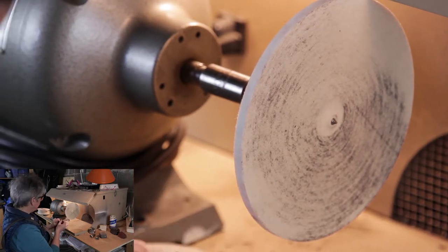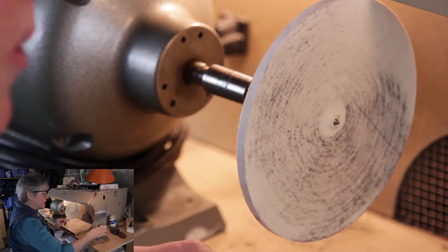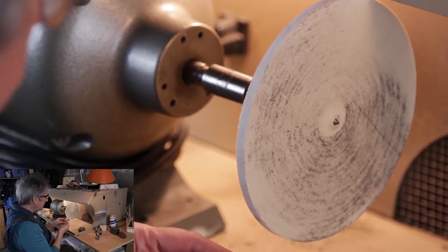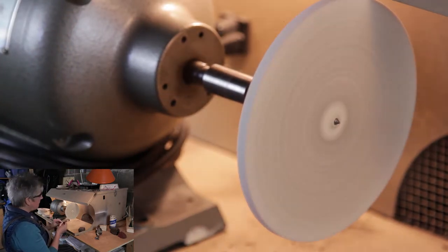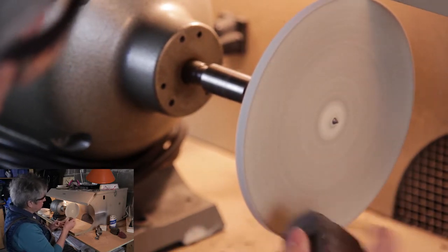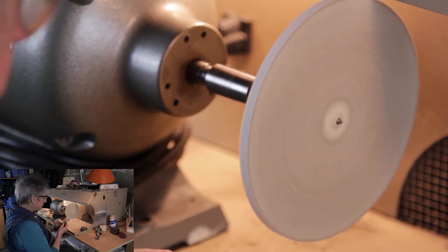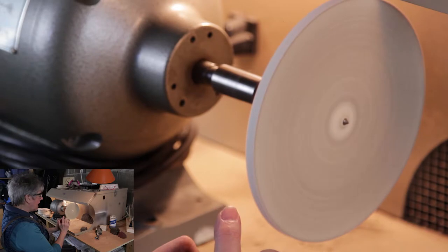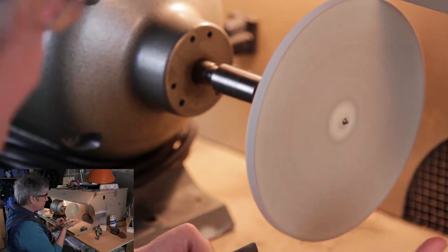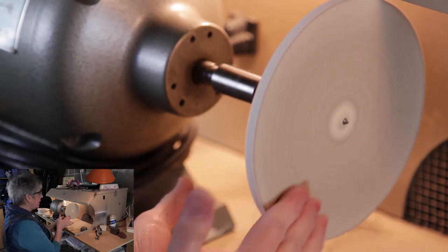Let's clear the decks here. This is Grey Star, so I've got my Grey Star handy. I'm going to start the lathe and off we go. Because this is a new one, I'm going to put a little bit more compound on — normally I would test it first. You could use a Grey Star lap or a Tripoli lap; it's whatever suits your fancy. I'm going to line this up and there we go.